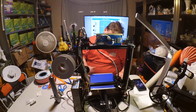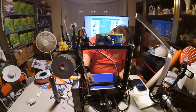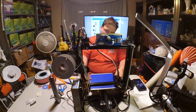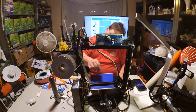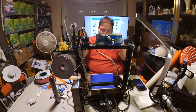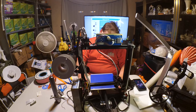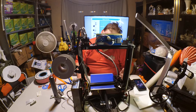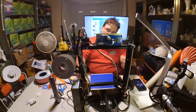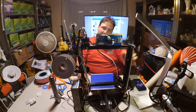Definitely going to need stiffeners for this. That's a little knock against it because this is not rigid enough. Well, this is rigid relative to its beam, and this thing is crazy rigid because they are both attached to an acrylic plate and not attached to anything else. They lose their rigidity because what they're attached to flexes. It doesn't matter how rigid this is if the whole damn thing moves because it's attached to a flexible acrylic